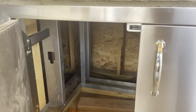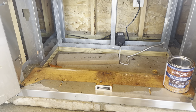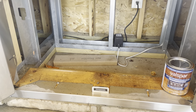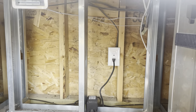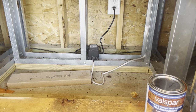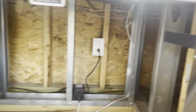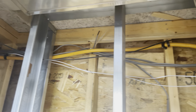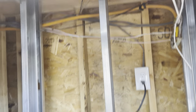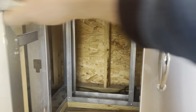Underneath, the cavity should be clean using metal framing. When they open it you don't want it looking trashy — there's your plug, your transformer mounted off the ground or on a back or sidewall stud. Keep the concrete clean under there. You've got metal studs all the way around for heat, one going across the back that supports the grill. Try to have your electricians keep things neat — even in unfinished space you don't want wires going everywhere.